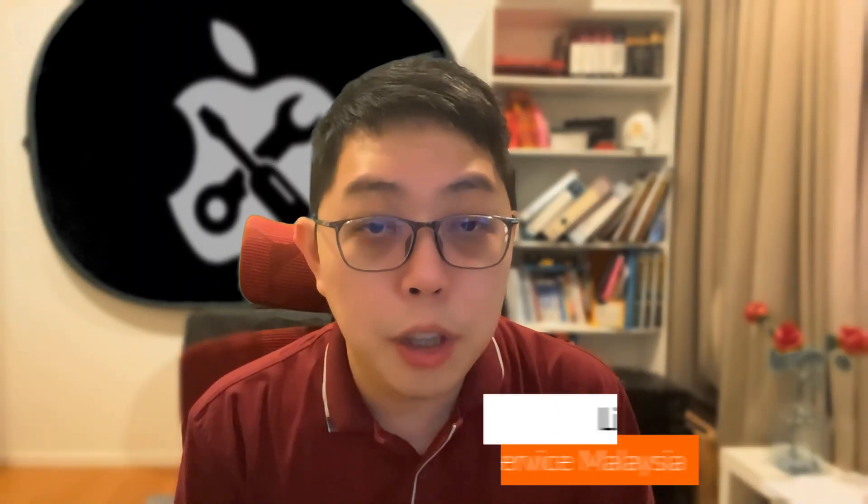Hi everyone, I'm Lim. This issue is very common for the iPhone 13 Pro and Pro Max. Many people say it happens after an iOS update — that the iOS changed the LCD voltage and killed the line. But I have already seen this issue when iPhone 13 was first released with its first patch. So software will not solve your problem.